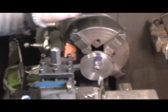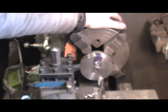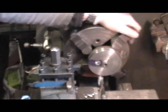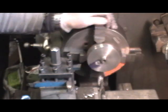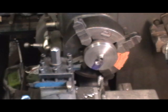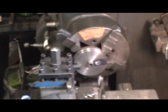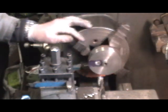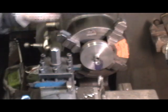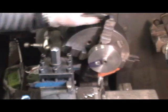It may look a little precarious for anybody on a beginner's curve in machining, but it's important that when you've got something offset like that with a big throw on it, you've got to make sure that your jaws aren't going to catch your saddle. Just do a little dummy run with the lathe out of gear and make sure nothing's going to catch. You'll be fine.